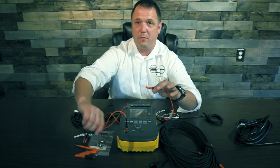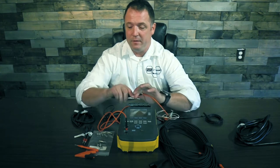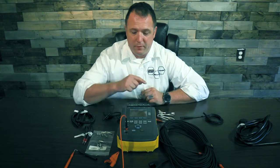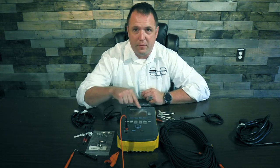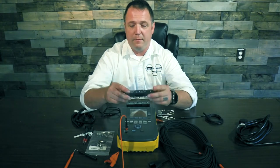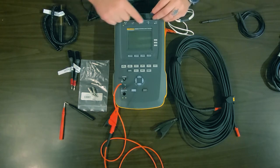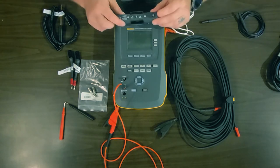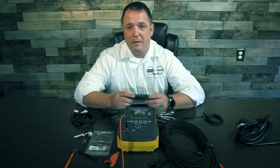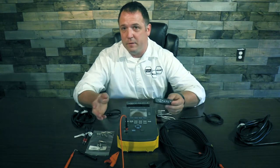If you lose the probe it comes with two — a red one and a black one — so it's an easy trade out. Now let's talk about applied parts. You have five applied parts ports across the top of the safety analyzer, and it comes with one five-snap-to-banana-pin adapter which plugs into those ports. You can put five banana pins in, or use the adapter for five snap pins. In a prior video we covered how to connect an entire defibrillator — three lead, five lead, or 12 lead — at one time.